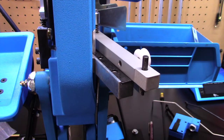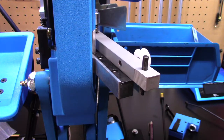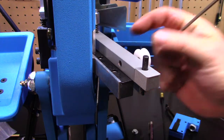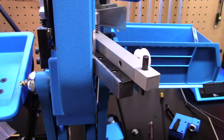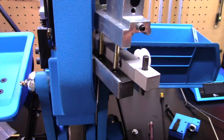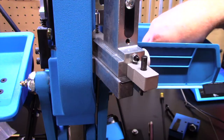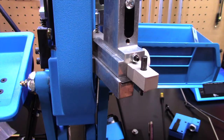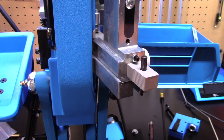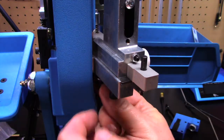Now we're going to install the primer body assembly back into position. On the 750, a lot of guys are comparing this priming system to the 550. While it's very similar, there are some really nice subtle differences — like this machined edge here to keep the phenolic plate in position. The thumb nuts are way better, and at the base of your primer body it has these studs that come through, which is a really nice feature. I'm just sliding them into the holes just like so. Now we just need to thread back on our thumb nuts — put the washers on, don't forget that — and thread them up hand tight, because we still need to adjust the position of the primer cup in relation to the shell plate to make sure we have good alignment before we snug things up.